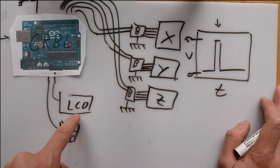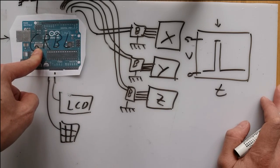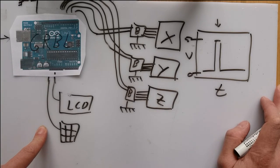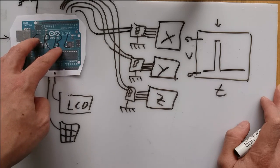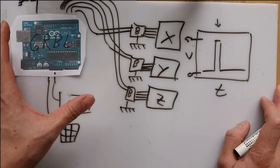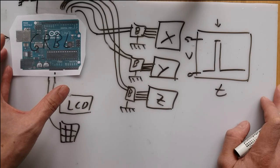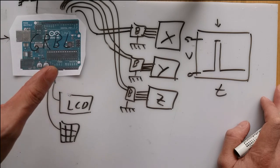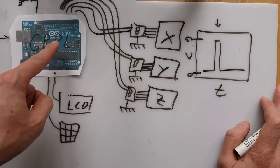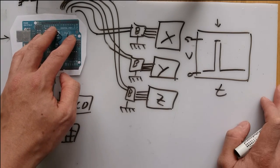And it does not end here. My LCD is supposed to give a live feedback, so how do I check what my GRBL is doing? GRBL gives the feedback via the serial port of the PC, but it is hard to get this information on the LCD. Another problem also, when I want to use LCD and keypad on that Arduino, I need to add my own software. The problem is that GRBL is basically maxing out the Arduino in memory and also in calculation power. Many functions of GRBL are super time sensitive because it needs to constantly communicate with the PC and give correct pulses to the motors. I really did not want to mess with that awesome piece of software.